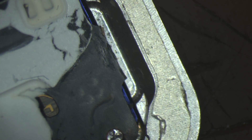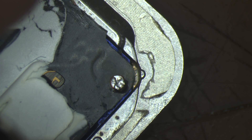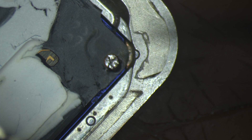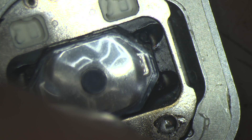The trick on the iPhone 6 and 6S is a little soldering point — just a little low-temperature solder on the point. Gently remove the socket with very tiny tweezers. Don't put too much pressure because you will lose your tweezers. Use it very carefully. Now, the iPhone 6 and iPhone 6S has only one layer flex, so we are going to scratch the first layer, which is the only layer.